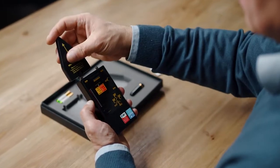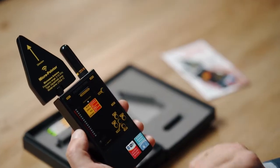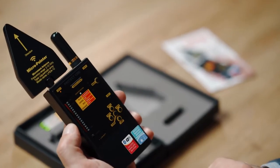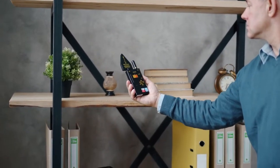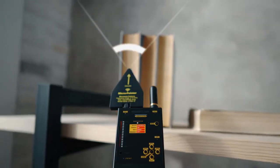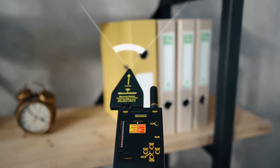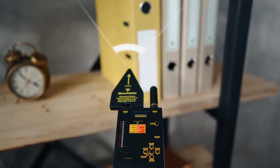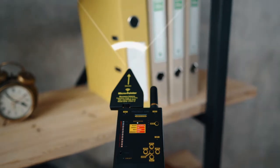Although the ROD Antenna can be used for detecting signals above 3000 MHz, the Micro Pointer Microwave Antenna can give better results on these bands. Additionally, the Microwave Antenna gives directionality for easy pinpointing. Therefore, it is possible to use the Micro Pointer Antenna in the left Antenna 1 socket for an additional search, instead of the Antenna 2 where it is as standard.